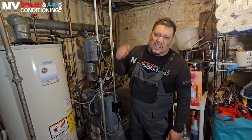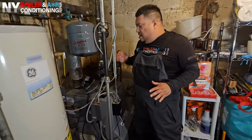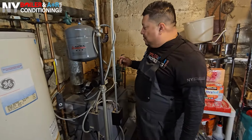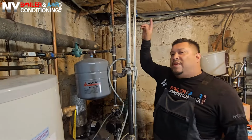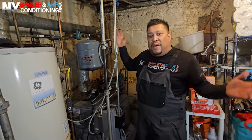Okay, mi gente, I just found the problem. Like I said early in the video, we're doing troubleshooting, and troubleshooting doesn't have to be that difficult. So we figured out that, number one, there's no purge valve on the return, but that's neither here nor there. We went upstairs and checked if there are any bleeders on the baseboard, and there are none.